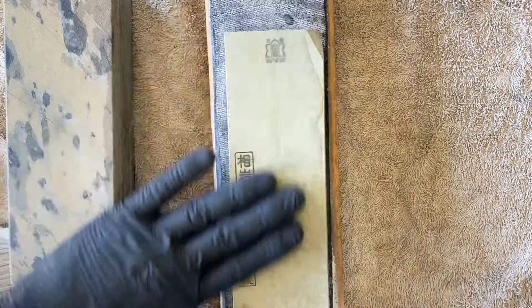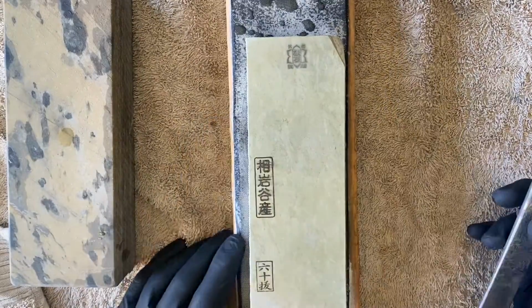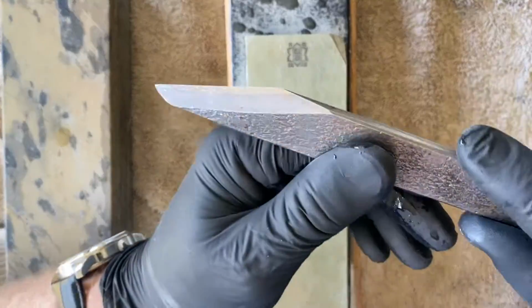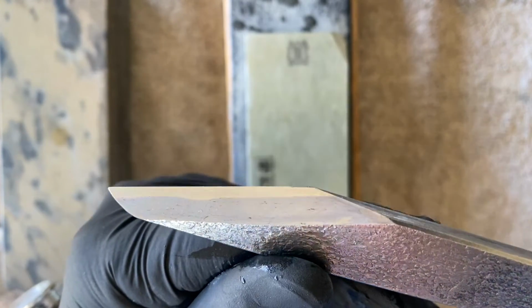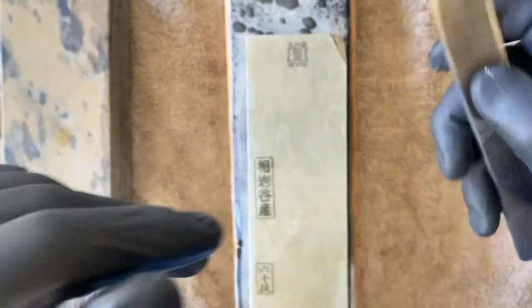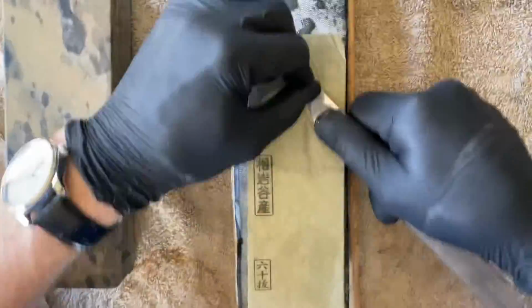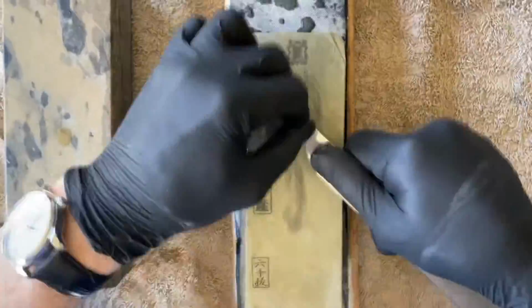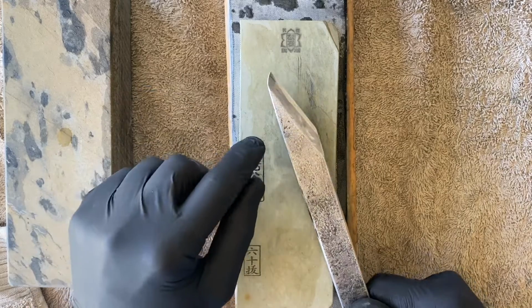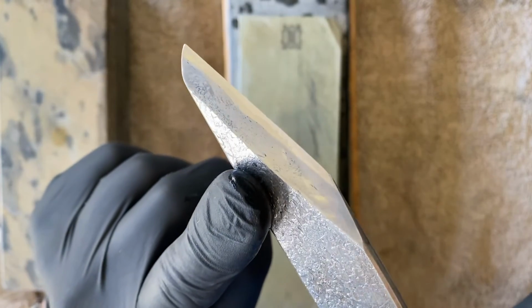So when you look at how the guys typically sell and demonstrate whetstones, they'll put the stone down there, they'll make use of a Japanese knife or kiridashi. And the reason for that is it's all about the polishing capabilities and the scratch pattern. So they'll take the kiridashi or whatever they've got, and perform some strokes on there, and as you can see there, immediately a lot of swarf, and then you can go and look at the scratch pattern and understand how the stone polishes.